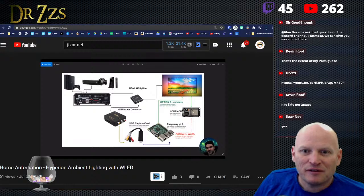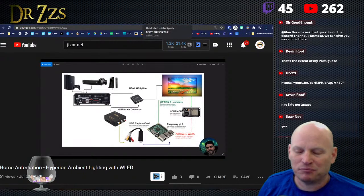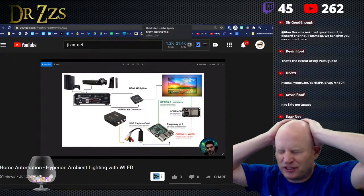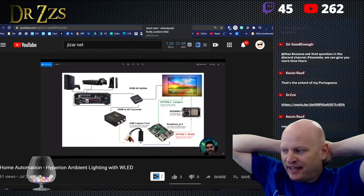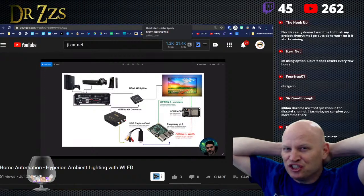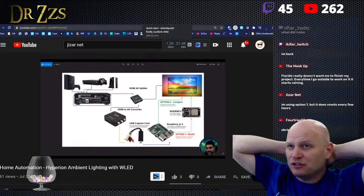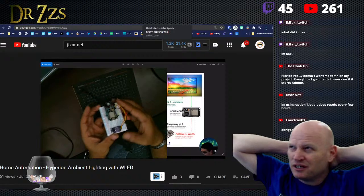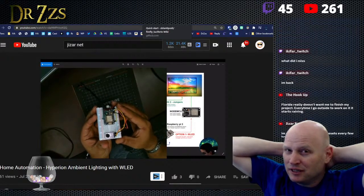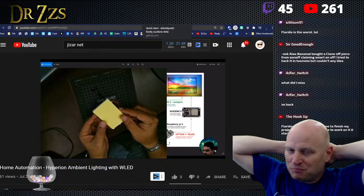So, yeah. My guess is, if you bought a Sonoff, or it said it was Sonoff and it's not, it's some knockoff, it probably still has the ESP8266 chip in it. So you could still get in there and manually flash it with Tasmota. You'd have to find all the right pins, the RX, TX, which I don't remember what they are on there. Anyways, you'll have to find them. Probably not going to be something easy for you, but is it possible?